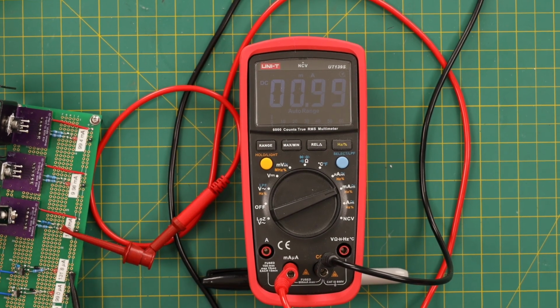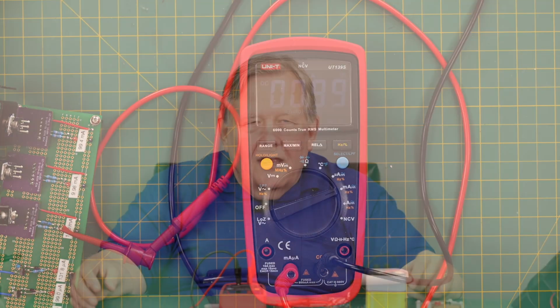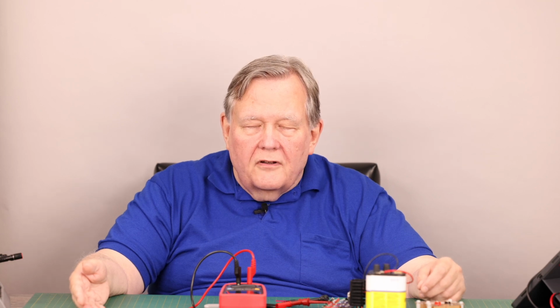Can't beat that. It is just interesting that the specifications in the manual are nowhere near this good. So the meter performs way above its specifications. The problem is, if you get a meter that doesn't do this well but meets the specifications, the manufacturer won't do anything because they'll say, well, it meets the specs as we put them. So this is a sample of 1 meter. You don't know what you're going to get, and your only recourse is to buy a meter that is specified as accurate as you need it, and then if it doesn't meet that accuracy, you can complain to the manufacturer and get warranty repair or get it replaced.